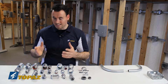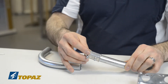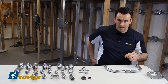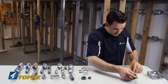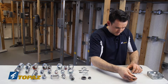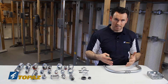To demonstrate how to use the EMT set screw coupling: I have two pieces of conduit and I slide the coupling on, then slide the other raceway in. As the name says, it's a set screw — I tighten the set screws so they secure tightly to the raceway. It's important to tighten them down very well in the field because that is your grounding connection. The EMT coupling is used to join two raceways together to extend them.